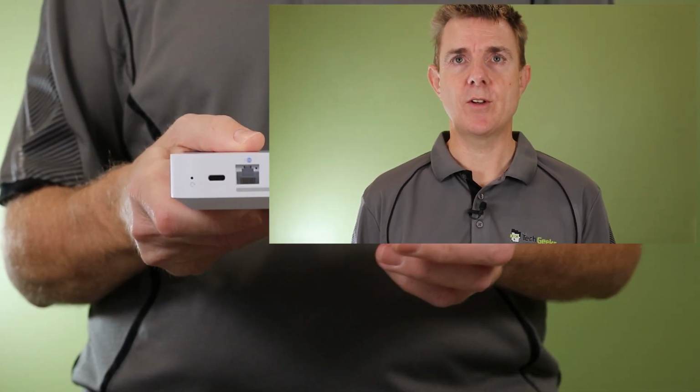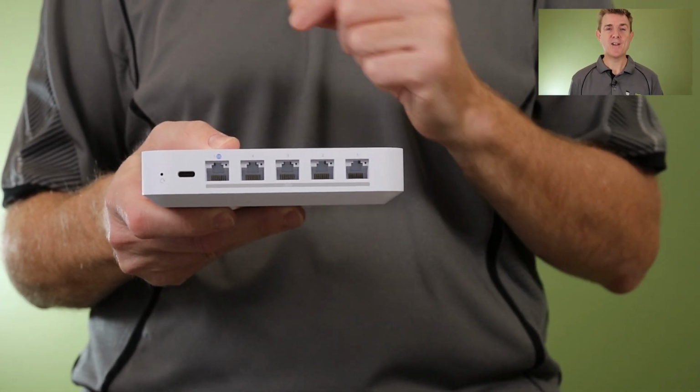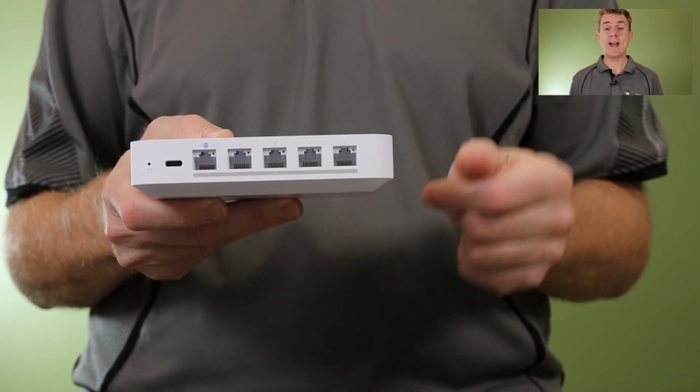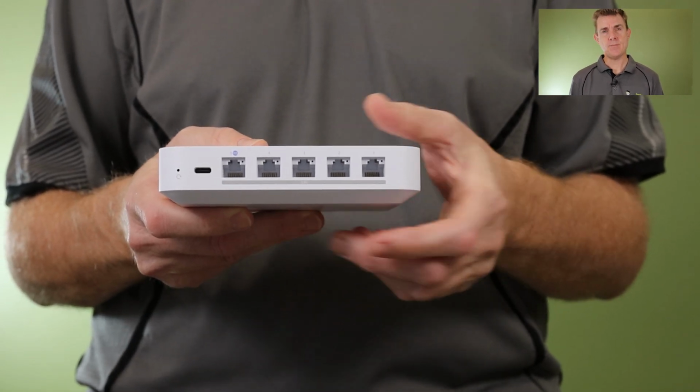We've got plenty of other videos on what's truly in the box. Give you a quick rundown though, just so you know, you've got 2.5 gigabit a second Ethernet ports. One of those is designated as a WAN, but you can have two WANs running on this, so it'll do load balancing and failover. We've tested this on our iPerf. We've got a 10 gigabit a second iPerf test server here internally, and we could get about 1.7 to 1.8 gigabits a second through this device.